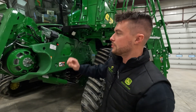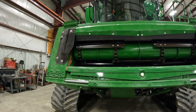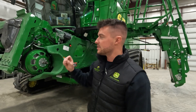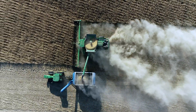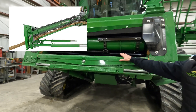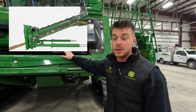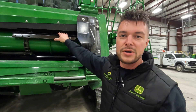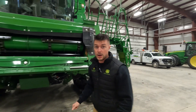Starting with the feeder house here, we have a 68 inch wide feeder house that's 23% bigger than our S Series Combines. So that gives us a lot more room to start feeding the crop through the machine right here — it's where it all starts. Inside the feeder house we have a pivoting mid floor that will articulate up and down as our crop mat changes to help reduce slugging. Our drum height never needs to change anymore from crop changes like corn to soybeans, like we had to do on our S Series Combines.